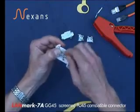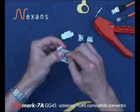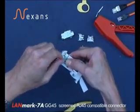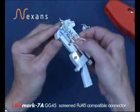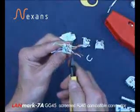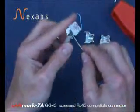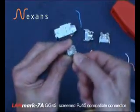In the case of a CAT7 termination, solid brown is to the outside of the two slots. All the other colours are to the centre. Open the tool up, slide it off, cut off the cores and take the braid over onto the strip.